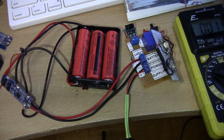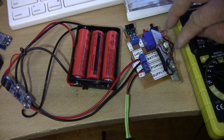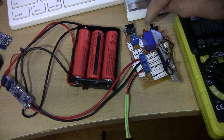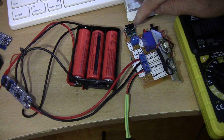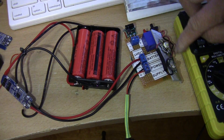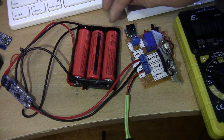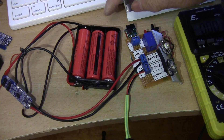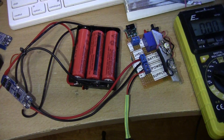I did a bit more work on my 12-volt automatic backup light. I got two 1-watt LEDs here, and I mounted the relays and the connectors on the circuit board. I also have a 1-watt to 3-watt LED driver for the LEDs, and I decided to use a lithium battery pack and a BMS to protect the pack.